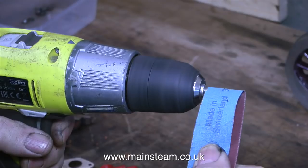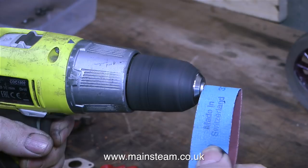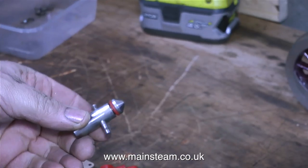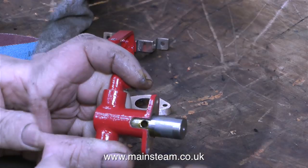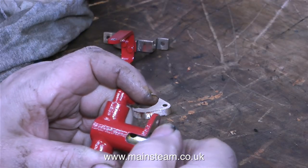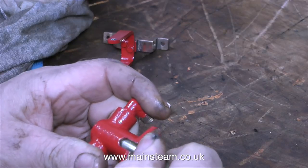As to sanding in the lathe or any other machine tool, I'd just like to mention something: what about a surface grinder? There must be a lot of grit in a surface grinder, so how do they work okay? Anyway, that's enough of this nonsense — it's time to put some lubricating oil on the pump ramp. To initially lubricate the pump ramp, I'm using some steam oil. Do not use motor oil — the additives will attack the silicone o-ring.